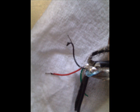What I've done here is strip those wires to get to the wire inside the red and black wire and get that insulation off. If you use wire snips, you have a very good chance of cutting off until you have no more wire. So I use the burn technique. You burn it and then flake off the burnt part, and voila, you just have the wire. And here's what it looks like after I've cleaned it up. When you burn it, you'll see the insulation actually catches fire, and when the fire goes out, you're down to the metal. So that's how I do that.